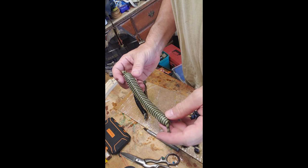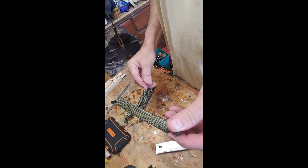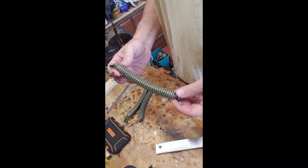All right. So I have three of these unwrapped. The next thing, we still have these hard tails. So the wrap looks really good. This is really hard. Everything adhered really well. There's no bubbles or anything. Really, wrapping it with tape is a great sort of a kludge if you don't want to actually vacuum bag something. So I'm going to cut these tails off with my little cheap saw here.